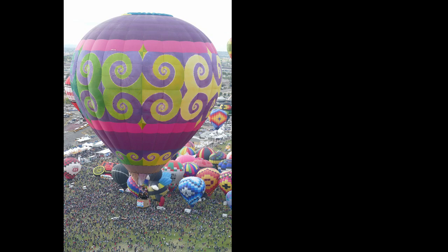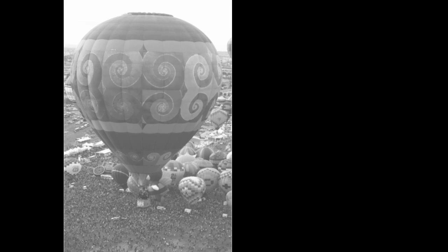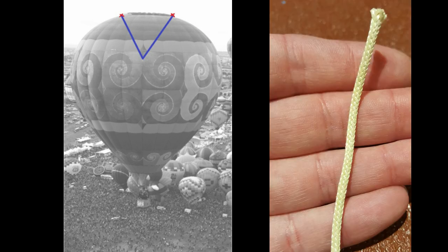We can take a close-up look at the internal workings of a balloon. Lines are drawn on here — in pink to demonstrate the candy line or the pilot operating line; in blue the pull-down cone, a series of ropes that we've talked about before but only been able to see from the pilot's perspective. There's a series of lines which radiate from the pulley to the edge of the parachute. And in green we have the retaining lines which are holding the edge of the parachute in tension.